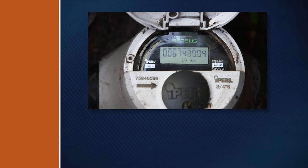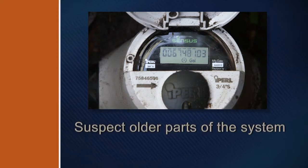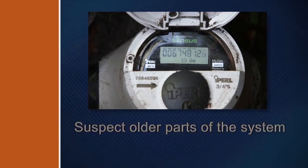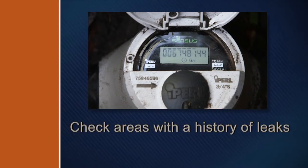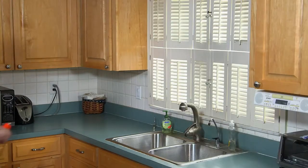The rest of leak location is a process of elimination. Assume you've got a leak if the water meter shows water flow yet all of the valves in the house are closed. Suspect older parts of the system, check areas with a history of leaks, and examine any recent excavations. Now let's do it for real.